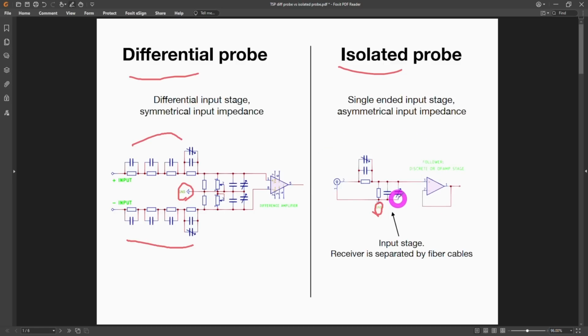That's what that tripod is for. So you will have, for example, a capacitor over here that will go into the ground over here, and that capacitor can indeed be reduced by elevating everything. And the amplifier really only sees the difference between 1 and 2, despite the fact that there is no symmetry in the signal here on the right side, and you're moving both the port 1 and 2 up and down together, and only the difference is present into this amplifier.